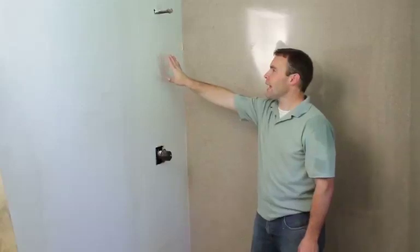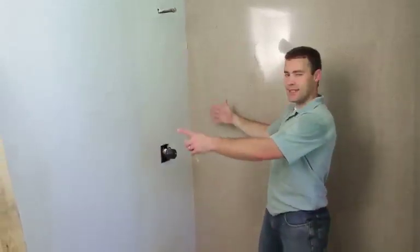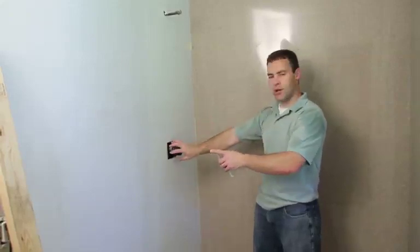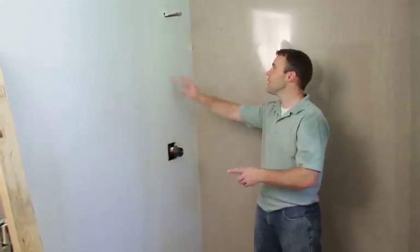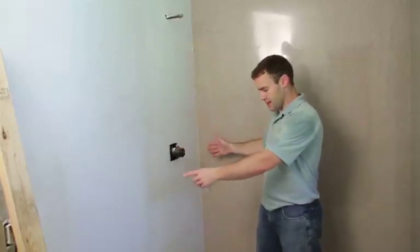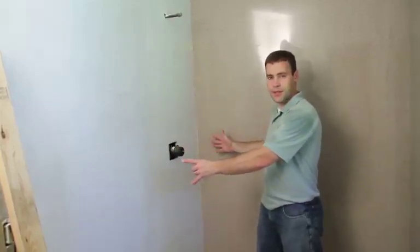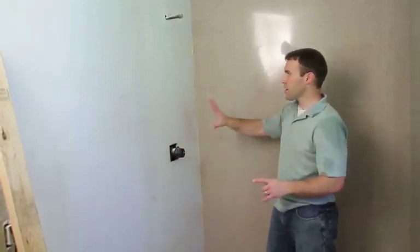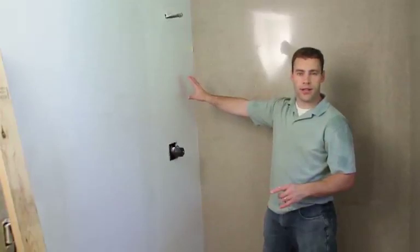Next is going to be the plumbing wall shower panel. And we're going to go ahead and size the panel approximately, get it close, and then also put our hole in for the shower control valve and the shower head. And when we do that, we'll go ahead and put it in place, see if we have any fine-tune adjustments, and then we'll make those after. So we'll take our measurements and then go out in the garage and cut the panel and bring it on in.